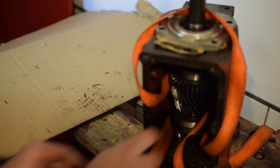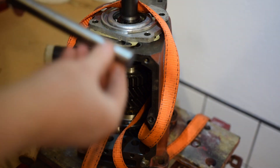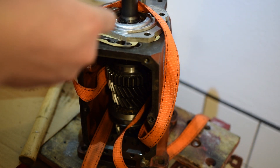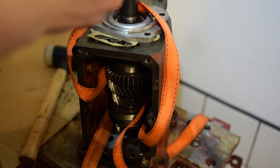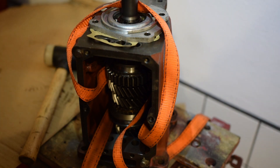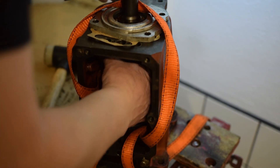The lay shaft should go into the correct location. To assist with positioning the lay shaft, I have put lifting straps under one end. The lay shaft is slightly thicker on one end — you can try it out to see which way it goes in. This end goes in easily, this end goes in with difficulty.